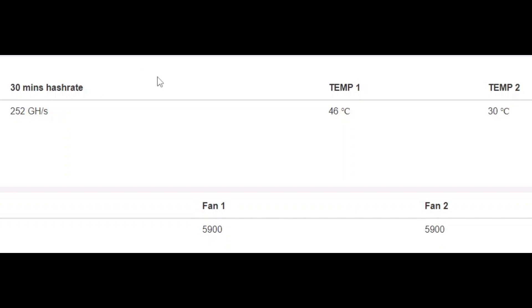It is an overclocked KS0 Pro right now. The fans are just blowing over the ASIC — I had to have them aimed perfectly to get them properly aimed at the middle, and it just doesn't work out. You need very concentrated airflow in just the right spots. That's why I want to try this Fruition Designs kit. I'll show you how to put it on, then we'll do some after testing.